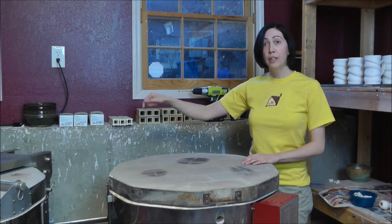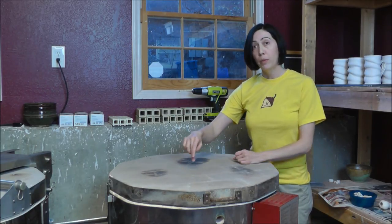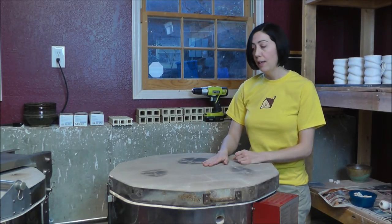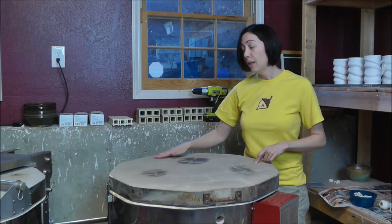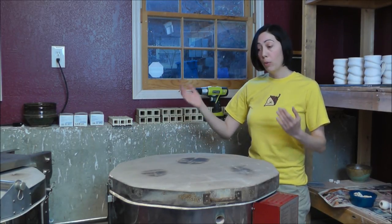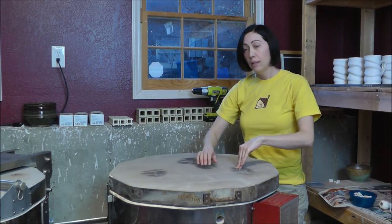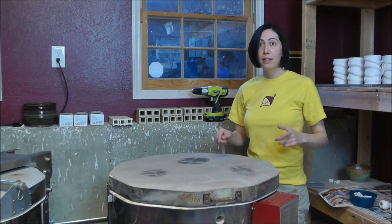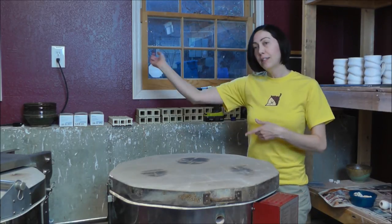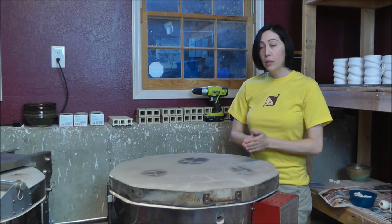What I'm going to do is connect ducting to a plenum cup that goes underneath this kiln. I'm going to put a couple holes — actually three holes — on the inside of the kiln at the base, and I'm also going to put holes in the lid of the kiln. That will allow the blower to pull air from inside this room through the holes in the lid, turn around inside there, and go out the holes on the base through the ducting and outside.